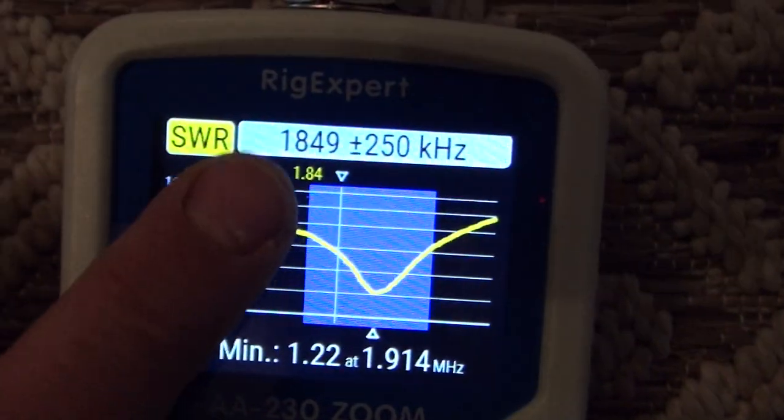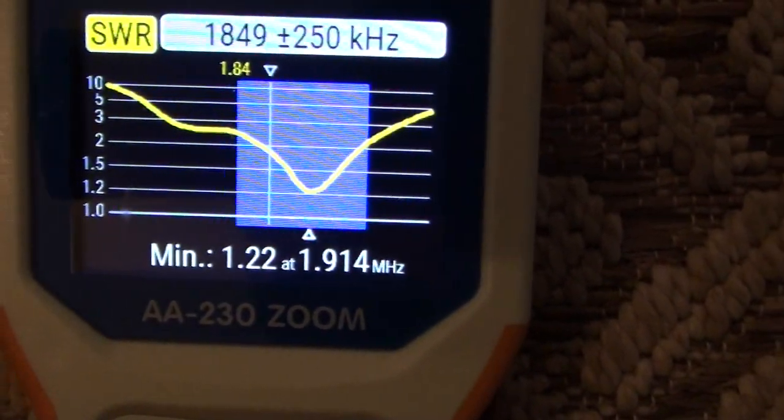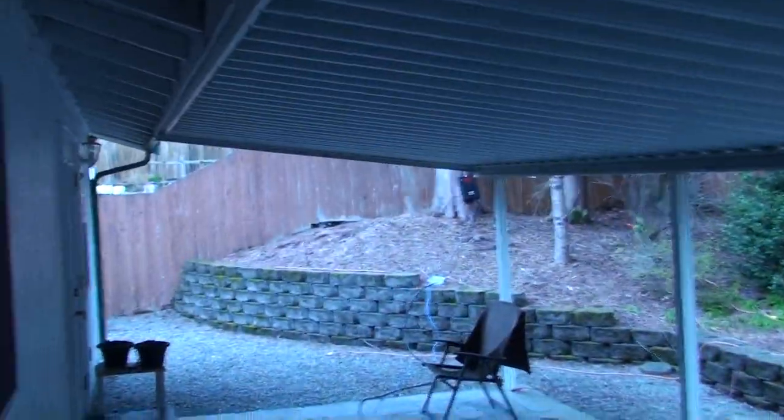I like to talk on the street and some of those other nets a little bit higher than 1840 — it's around 1847, 1893 — so the SWR is not all that good there. But the interesting thing is when I turn on that other loop antenna, which is my long wire with the SG-235 tuner. It's an active electronic tuner, and I have a mess here with clip leads. When I power it on, this is just going to send 12 volts out to that black box out there.